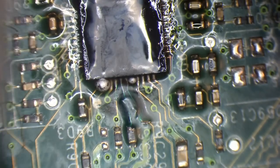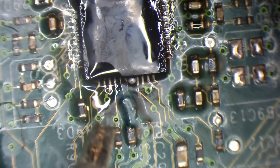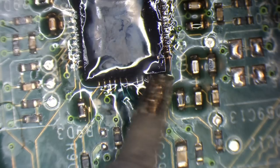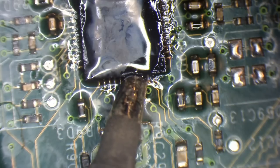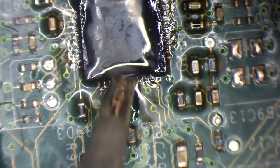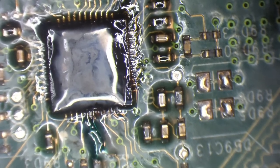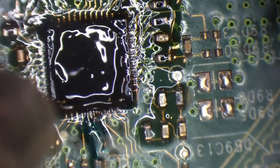It's a lot easier to clean the fingers on a graphics card. On a graphics card, I use a rubber, pink rubbers. They work well for that. Most of it, don't use those fiberglass pens or gold plate, because it takes the plating off. I use it if I just got to get some conformal coating on. It depends on the job.